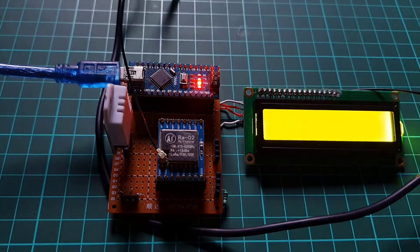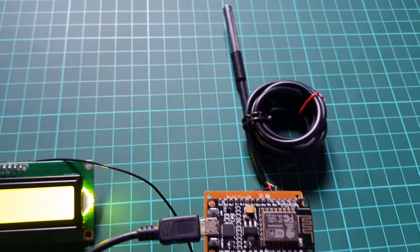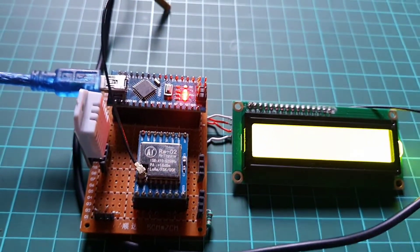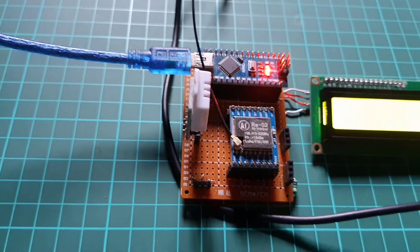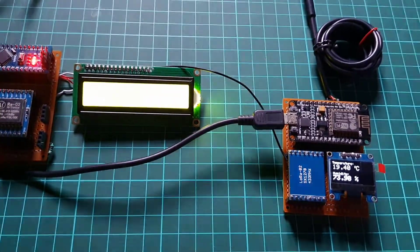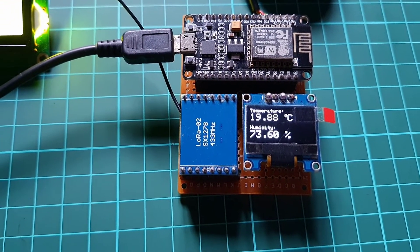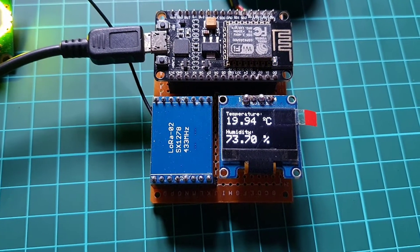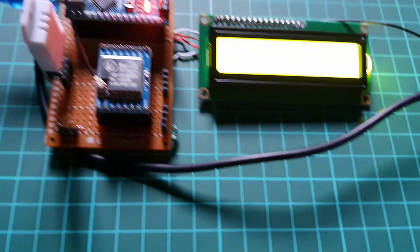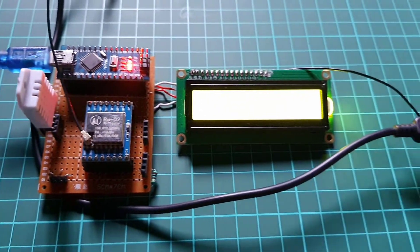In this tutorial, you will learn how to make a wireless 2-way communication system using Arduino and SX-1278 LoRa transceiver modules. I am using Arduino and ESP8266 module, but you can use any Arduino on both nodes. The DHT22 temperature and humidity sensor and 16x2 I2C LCD display are connected to the Arduino node, while the DS18B20 temperature sensor and 0.96-inch I2C OLED display are connected to the ESP8266 node. Parameters from the DHT22 sensor are sent from the Arduino node to the ESP8266 node and displayed on the OLED display. The DS18B20 temperature sensor data from the ESP8266 node is sent to the Arduino node and displayed on the 16x2 LCD display.